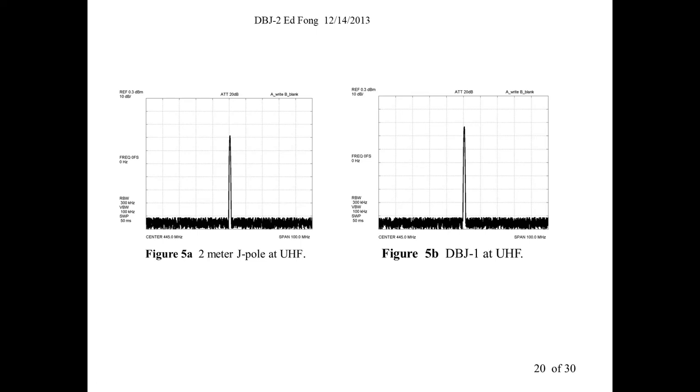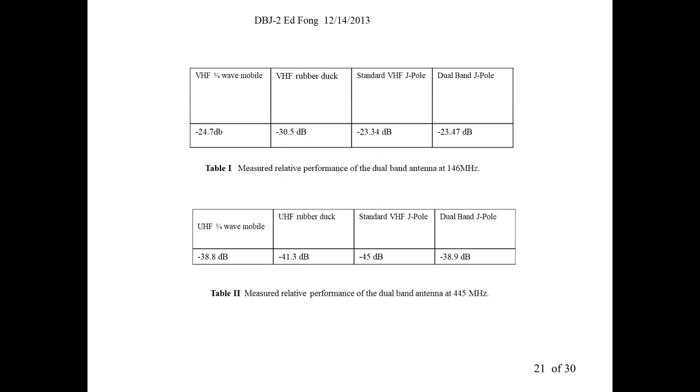It's not insignificant. And then I got these numbers. These are the actual measured numbers on how you would evaluate an antenna. The reason why I did this is one of my students wanted to learn how antennas are really evaluated at the National Institute of Standards. You don't just say, hey, I think it sounds good. It's more quantitative than this. You've got to measure it with obviously calibrated equipment, in our case, Keysight and Agilent type equipment. For an antenna, it's got to be done on a rainy day, on a foggy day, and on a clear day. Typically, they recommend 5 measurements each, and then you take the average. And you know what we found when we did this? It does come really close to modeling, the ideal stuff when you run it on a computer, really, really close.